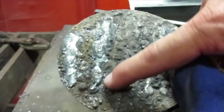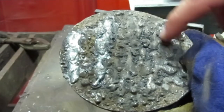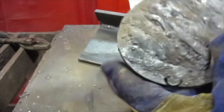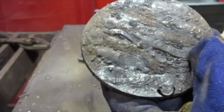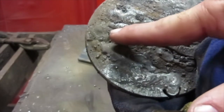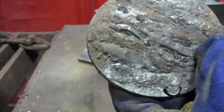We have a little bit of slag here because of undercut. This one — the student did a weld and just went on and did another weld, and never chipped off that slag. This is a beginner welding student, so the welds aren't going to be fantastic, but we can see slag in here that never got chipped off. You've got to make sure you get that slag chipped off.